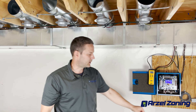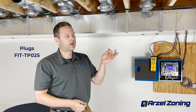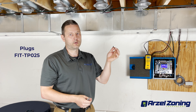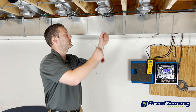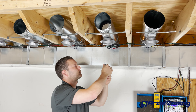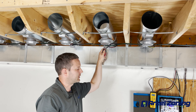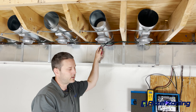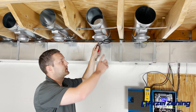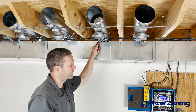After that I'm going to need a plug. These little plugs that Arzell offers are an FIT-TP025. These are going to let you isolate your dampers. So by plugging off my airline with the plug, I can then pinch it off after that T. I notice that my pump noise instantly changes and my pressure shoots up to 63 inches. That proves that this damper was leaking because I've isolated it and I'm getting the correct pressure now after my T.